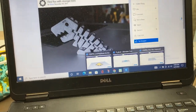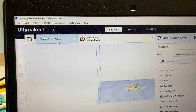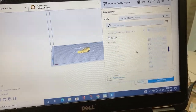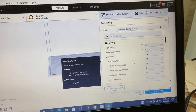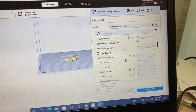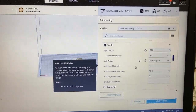There's my flexi rex. I obviously have to make sure I switch to the right printer — I didn't switch to the proper printer one time and the other printer did not like that. I'll play with some settings. I always look at what Thingiverse recommends and stick with that. I've been playing between layer height 0.2 and 0.3, trying to go with four walls and four layers top and bottom.